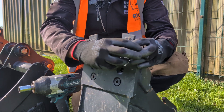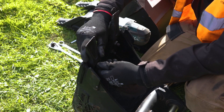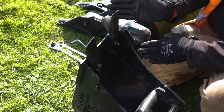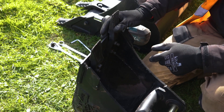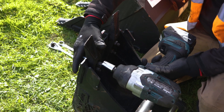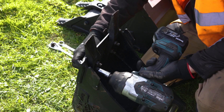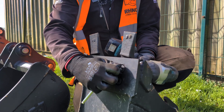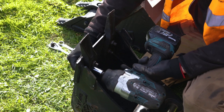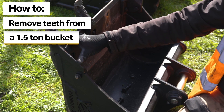I'm going to get the second bolt and put it through the top hole, again followed by the spring washer and the nut. Just note that micro teeth are not designed to be straight — they're designed to have a slight angle to help get to the edge of the trench. I'm going to use the allen key in the bottom again with the socket and impact gun, winding one bolt on first to make sure it's lined up properly, followed by the second one, then making sure both bolts are tight.